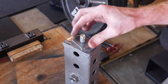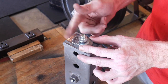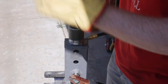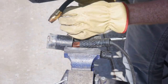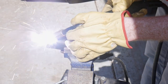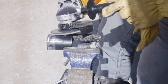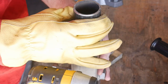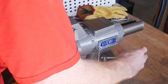I'm going to be modifying the clamp on my current knife vise so that it has a cylindrical section to be clamped into the pipe vise. I am constructing this addition so that it can be bolted on to my current clamp, just in case I ever want to go back to the old system. I can see myself down the road having two of these assemblies — one with a pipe section in the pipe vise and another in the more rigid original design. At this point I have my plate welded on to my piece of pipe; it has a half inch hole in it and then I have a nut that I will thread through the pipe and connect the two together.